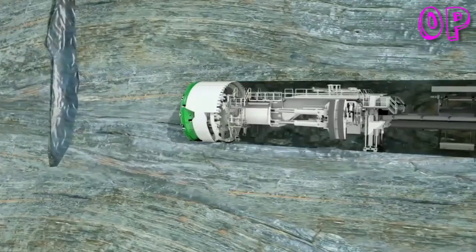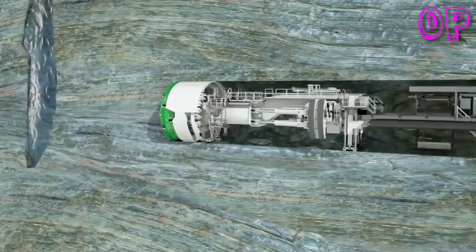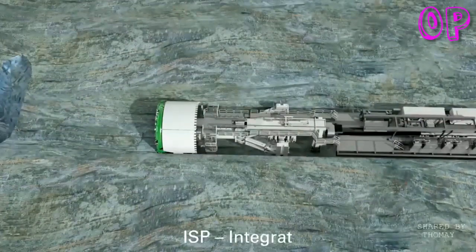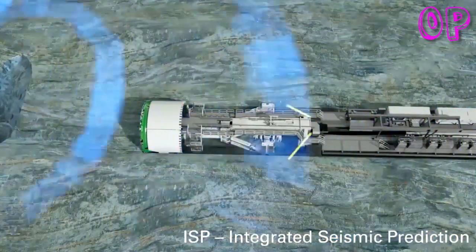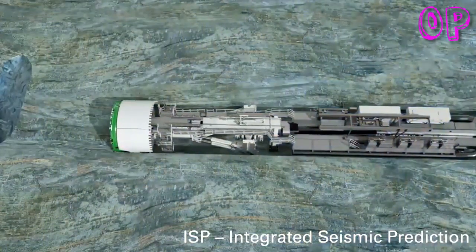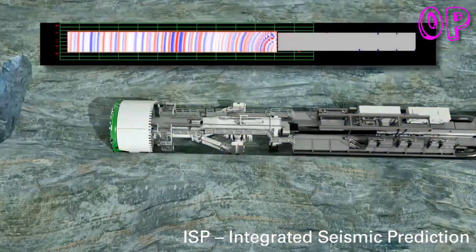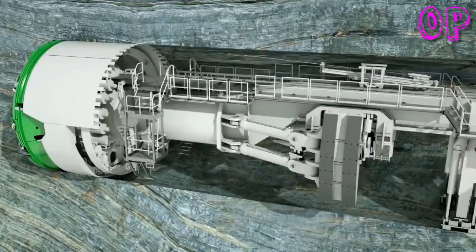Additional equipment helps determine an optimal tunneling strategy and rock preparation. In hard rock, water and air-filled cavities in particular, as well as abruptly changing weak zones of the rock, are a potential source of danger. With the help of the Herrenknecht Preliminary Exploration System — ISP — these can be detected at an early stage. A pneumatic hammer blow on the tunnel wall sends a surface wave along the tunnel wall; at the tunnel face it is transformed into a space wave. When it encounters an obstacle in the rock, a response is generated via the reflected space wave, enabling detection of greatly fragmented rock, water, or air-filled cavities. The results of the ISP exploration can be verified by probe drilling. Herrenknecht offers probe drilling units with a range of up to 100 meters ahead of the cutter head.